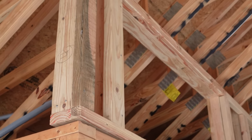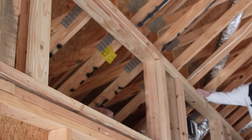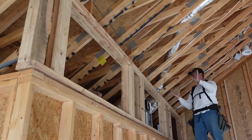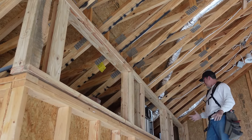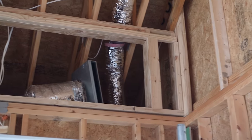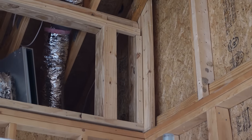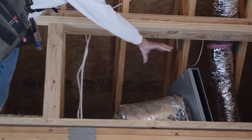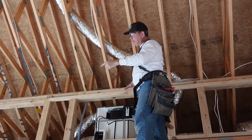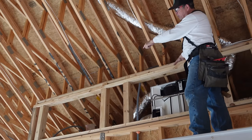All right, guys, this wall is all padded out. We have our little ledge here following our laser line. That's where our LED is going to be shining up on our wall and our ceiling. It's going to look insane. Got all this padded out for our 3 access panels. And we got our blocking over here for the drywall corner. Just have to clean up a couple of wires, move this intake for the ERV. And one more thing we have to do. We got that little corner over there, that triangular piece on the end.